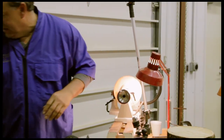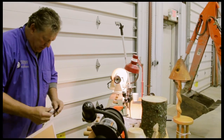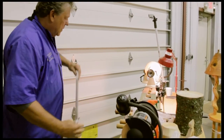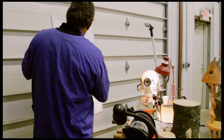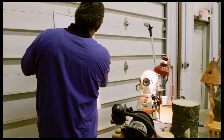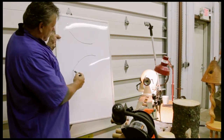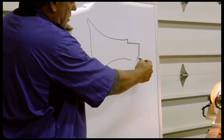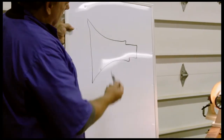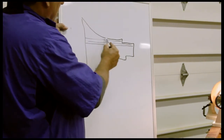And this project, for those of you that don't turn a lot or are just learning, is a spindle turning because the grain is running the length of the lathe. So you gotta let the camera see. Oh, I'm sorry. So this is our piece of wood, basically. That's what's inside the chuck that you can't see. And all the fibers are like straw or celery. They're all lined up this way